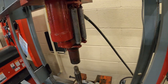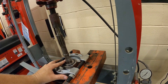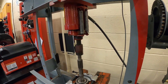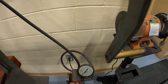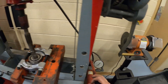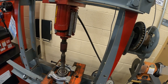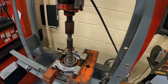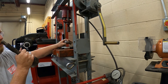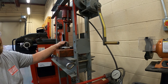From here it's basically the same process - the only difference is we thread the press head down so we can start a little bit sooner. Center that up, make sure the lever is on pump, and then start to apply hydraulic pressure. We're just starting to move it - those noises are normal. As you can see off our gauge we're not applying that much torque, probably a couple hundred pounds at most because this bearing isn't going on that tight. Trying to catch the shaft before it falls so we don't run the risk of it landing on our foot or wrecking the piece of work.